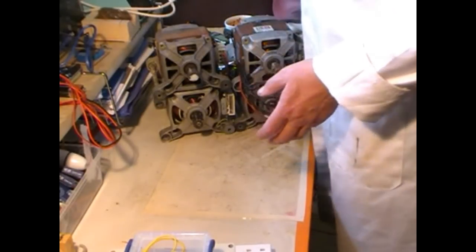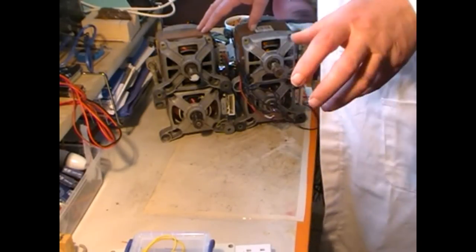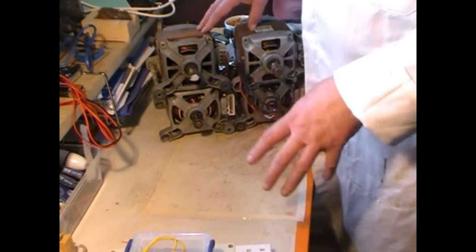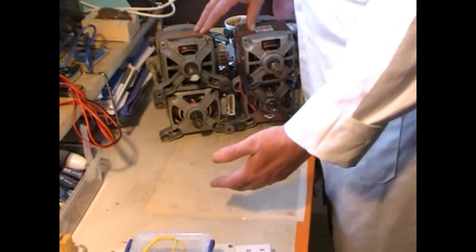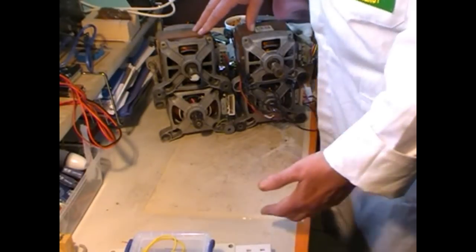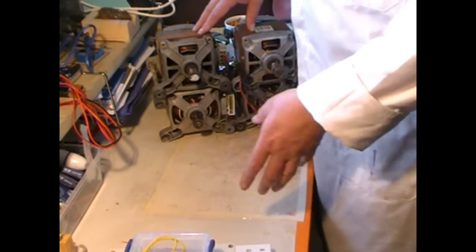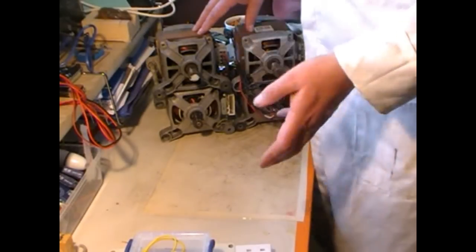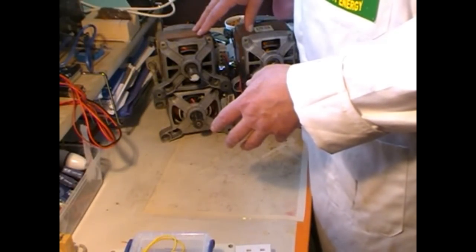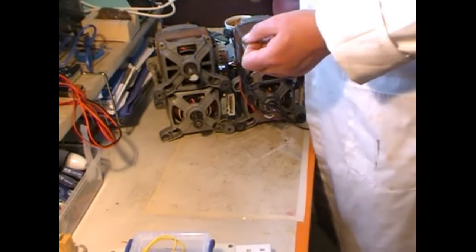I've already got the design sorted out with T-Man for the chain driven steering column. No, I don't think that's right. It's going to be a small cog at the bottom of the steering column through a chain driving a bigger cog, which will then turn just 2 wheels. So that you've got, like in a normal car, several turns to make the wheels go where you want them to go, which then takes out the juddering steering like you would get in a go-kart, which is direct linked.